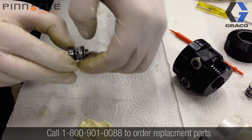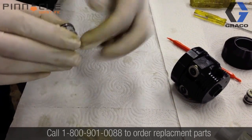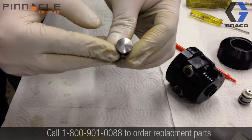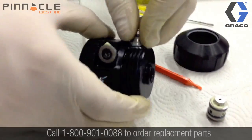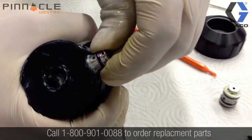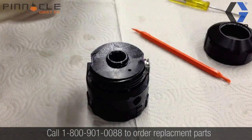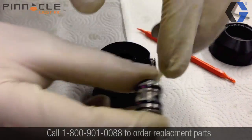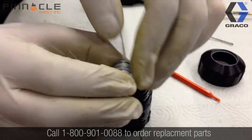Apply a good liberal coat of grease over top of the o-rings, making sure that we put the A side into the A side and the B side into the B side. You do not want to seat these completely, as we need to have space for the mixing chamber to slide in between them prior to assembly. Now we'll insert the B side, or the A side.